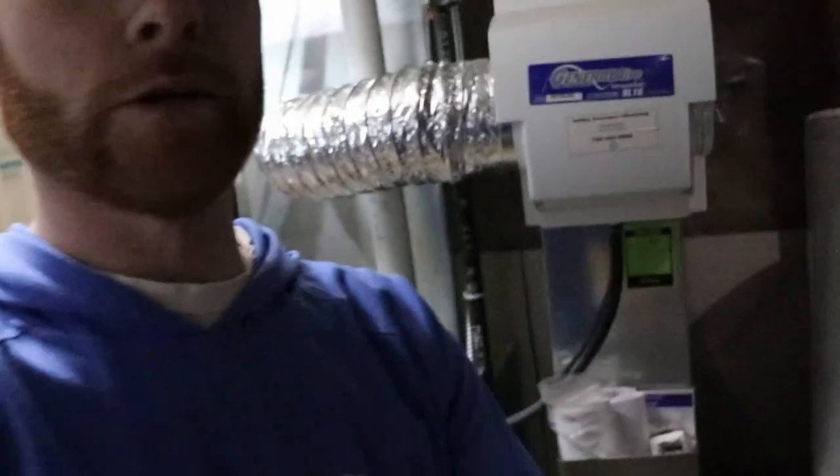was pretty much all gone because he has a water softener in his house, so it has filtrations and it introduces a little bit of salt into the water, which obviously eroded and deteriorated that anode rod, and that's its purpose. But I'll show you what mine looks like.